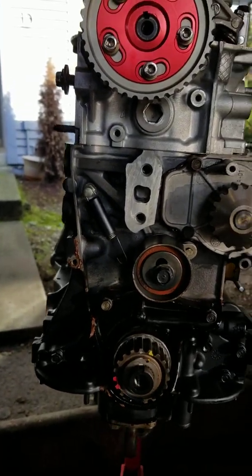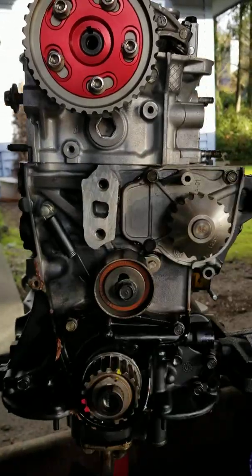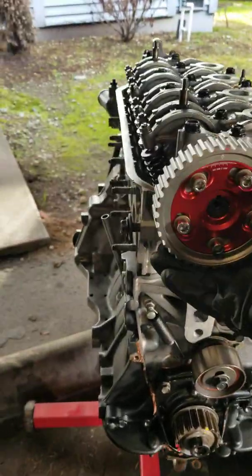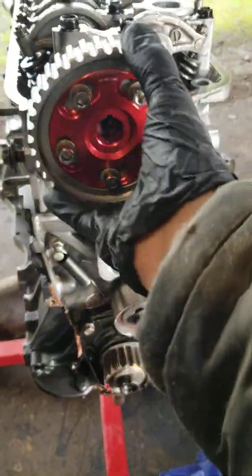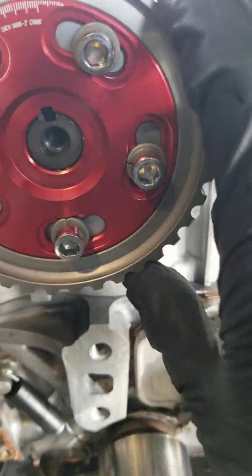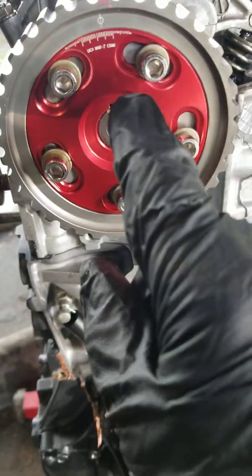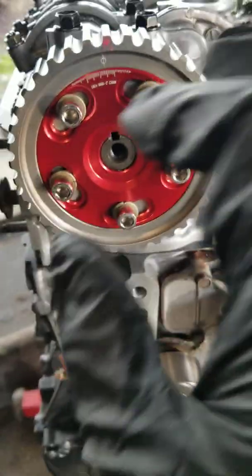That's all stuff that belongs to other conditions. If this is loose, you check it, you tighten it, and you're good to go. One thing — when you buy this kind of item, be aware: the key that you have to make is a step key. The shaft is a little short and the pulley is a little wider, so you have to work it out and make it happen.